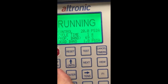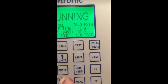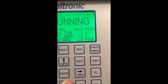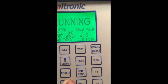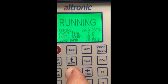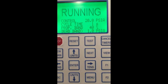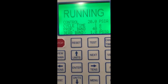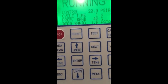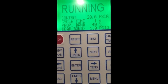So I'm going to take it back down closer to 30 because I kind of like the response of that. We'll stop at 40. And notice I have a dead band. The dead band controls — okay, my target's 20 PSI — and I'm saying, if I get down towards 19 or towards 21, that's my dead band. Don't move. Don't pulse at all.